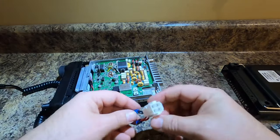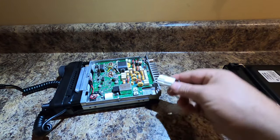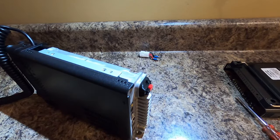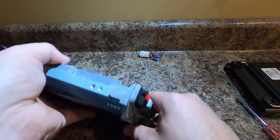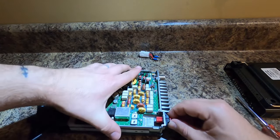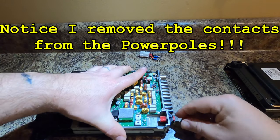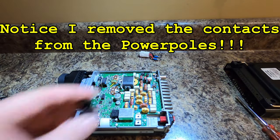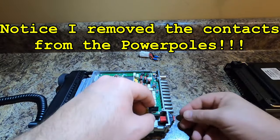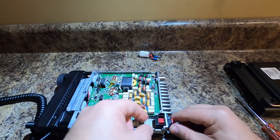We're going to lift that out. Now hang on to that — if you want to resell it, most amateur radio operators, hams, probably wouldn't mind if this wasn't in there. This piece is in there extremely tight. So that's what that looks like. Now the next thing that you have to do is on the back side, this piece goes over it like this. And that's where your screws come in.